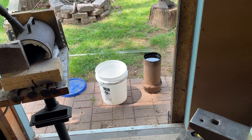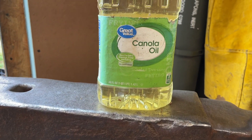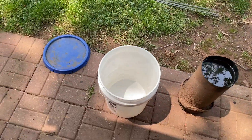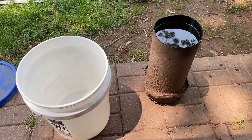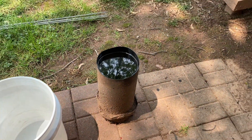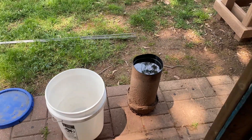First, canola oil from Walmart. I found out that these little 1.42-liter containers are a lot more affordable than buying the gallons. You'll need about 12 of them to fill up a five-gallon bucket. My original quench oil used to be used automotive oil — it worked fine for simple steels like 1084 and railroad spike, but the problem is it burns and smokes, so it's messy. But it's free, so if you have oil available you can start with that.